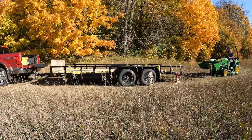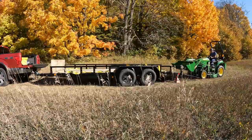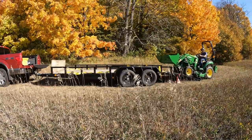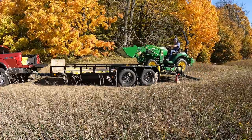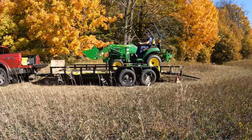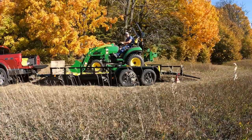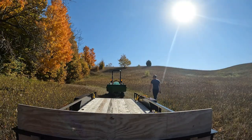Here's a side view of loading the tractor onto the trailer. Pull the bucket up, move towards the back. You want to have it in four-wheel drive — those front wheels need traction to help get up the ramp. Use low gear and go really slow. Just line it up at the back and let it slowly crawl up. You can see the back of the trailer stays very stable — nothing is getting picked up because I've got that rear support. As I get closer, I drop the bucket down so I can see where the front is. Get it a little bit forward of the tandem wheels, put the bucket down, and lower the three-point hitch in the back as well.